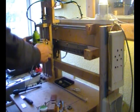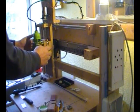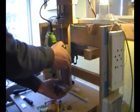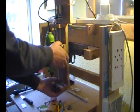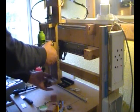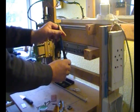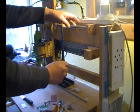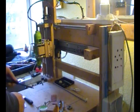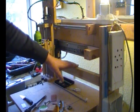The fiberglass backing is probably sliding up and down the bar. The reason for that is I discovered that it's a bit tight towards each end, and I found out that if I pulled this slightly this way it travels perfectly backwards and forwards. In other words, what's happening is that the z-axis is doing that, and because it's pulling on these bars at the top, it's dragging. So this is my remedy.